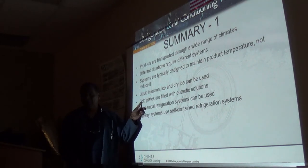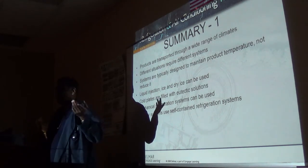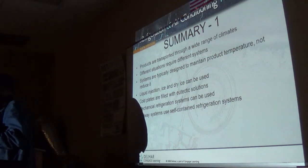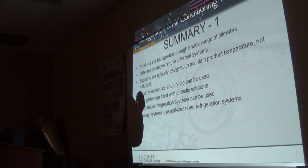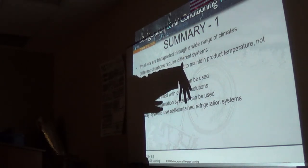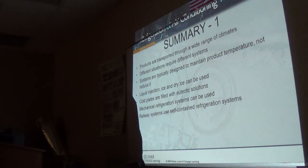Even this, you can have an explosion internally in a compressor too if things are right, especially with a really hot compressor. No matter how much you think you released all the pressure out of a compressor, guys, before you put a torch to it to remove any sweat or braze off any line, leave at least one part of that compressor access open, either the suction or discharge, whatever you want. Leave a port open to the atmosphere.